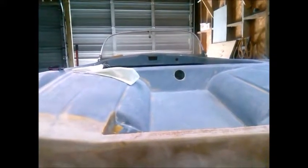Once I did all of that on the outside, I went to the inside and put a six-inch piece — three inches this way, three inches down — like a tab, and resined it up on the inside to bond everything. Now, I want to make it very clear: I'm not a boat guy and I'm not a fiberglass person. I'm only doing this work because I watched a bunch of videos. My terminology could be wrong, and I'm just on a learning curve doing the best I can. I do have some mechanical knowledge, and I try to help other people by showing my mistakes — because I've made a ton of them, especially on the fiberglass.